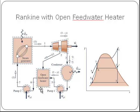And that will actually allow me to solve for the mass flow rates in the various streams. If I know one, I can figure out the others. If I don't know any of them, then I could maybe say that the stream coming out here and that's going to come on through here, that's 100% of the flow. I'm going to have splits here, so I could say 100% is Y, and therefore this is 100% minus Y. Okay? So Y plus 100% minus Y will add up to give me that 100%. And that way I can have a fraction of flow, not necessarily a specific flow rate.